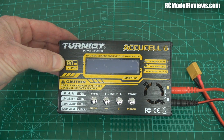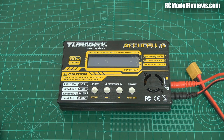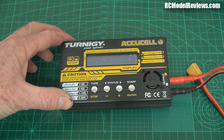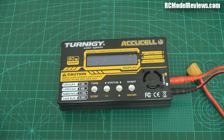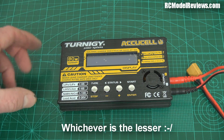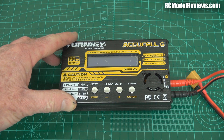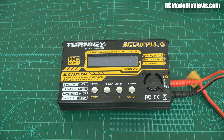It is an 80 watt charger, which means it's more powerful than the earlier ones, which I think were 60 watts. And it'll charge up to 10 amps. Of course it won't charge a 6-cell battery at 10 amps because the watts come into play — it's either 10 amps or 80 watts, whichever is the maximum. So you're not going to get the full rated current at a high cell count. Probably get it on a 2-cell pack, probably not on a 3, certainly not on a 4, 5, or 6.